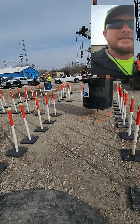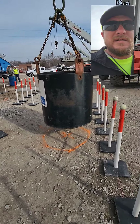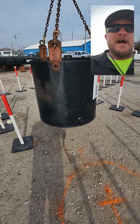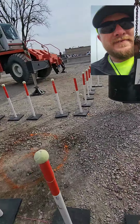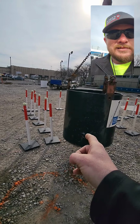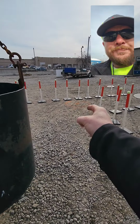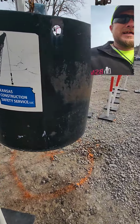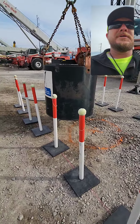We went somewhere last weekend and did some crane training, a Saturday and a Sunday. We rotated in and out of the cab, him and myself, for 2 days, about 8 hours a day, so that's about 4 hours each, and then we've been working with this. See, he just hit this orange circle. Now all he is doing is swinging. That ball is already knocked off, I believe. But even if you knock a tennis ball off, it's not that big of a point deduction. See, he's missing this inside corner. He's going to point B, what we've got drawn out right here. When he boomed back and hit that corner, all he did was swing. He didn't boom up, boom down, hoist up, or hoist down. Now that he's hit this, he's gonna boom up and hoist down to hold his load, and work himself out.